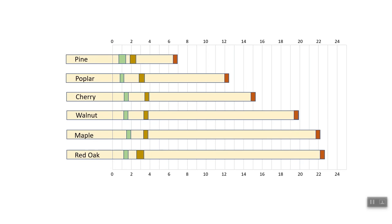One thing that bothered me is that the glue failure strength varied so much from species to species. If the only thing that fails is the glue, and all samples are glued with the same glue applied under the same conditions with the same technique, shouldn't all the end grain samples fail at about the same value? It turns out PVA glue does not form strong chemical bonds with the wood. Instead, it penetrates into microscopic pores, channels, and defects, and grips those irregularities tightly. Thus, the strength of the bond is partly dependent on the internal microscopic structure of the wood fibers, which varies from species to species.